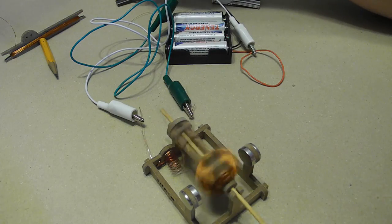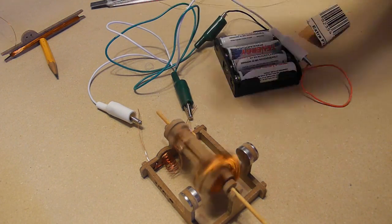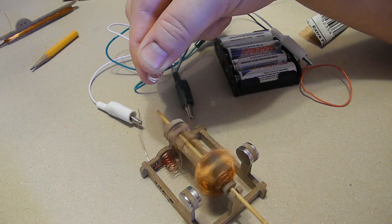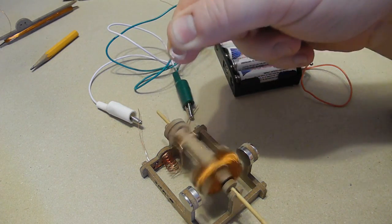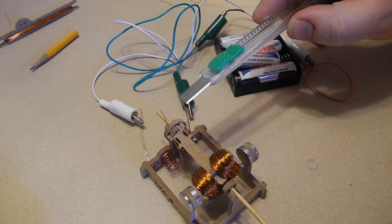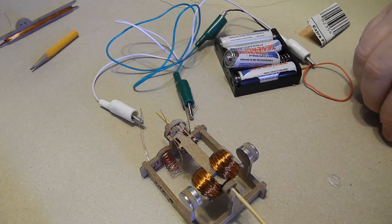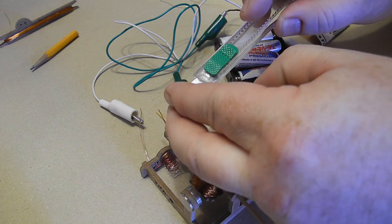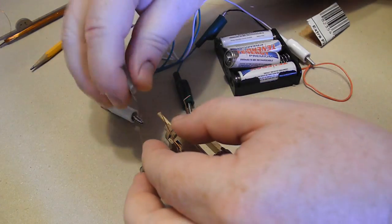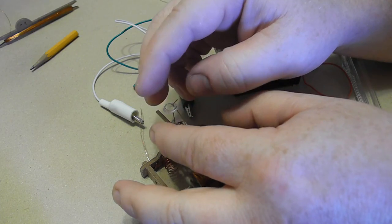So what I like to do is you take this little hoop that was helping hold the wire together. I can't find mine. So you can take this little hoop here and you can put that on there as a brush tensioner. So here's how: you first shut the motor off, and you want to make two little notches on there so that there's a place so this will stay in place. To do that, very carefully just bend it so that it's a little notch without disturbing the adjustment too much of the brush. Again, so just notching that out so that if I put this on, in theory it can't fall off. There.